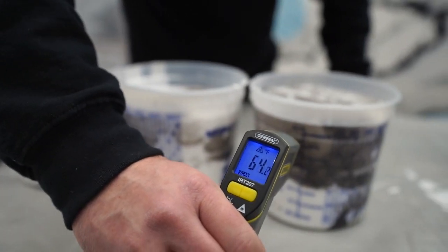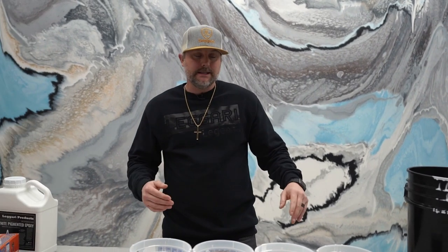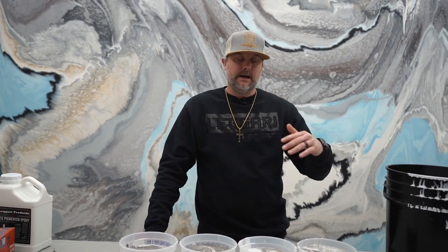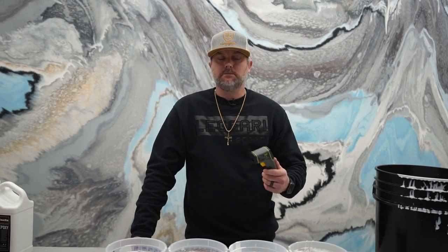Okay? So slowly climbing. It's been about 10 minutes, maybe 15 at most. But again, remember, we started with this resin really cold. So if you guys start with the resin at like 70 degrees, it's gonna kick off faster. So there's a lot of variables when doing this. And that's why we highly recommend only doing this technique when you're an experienced installer, very familiar with resin.